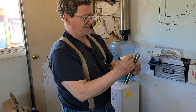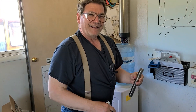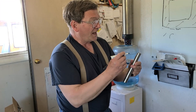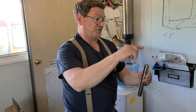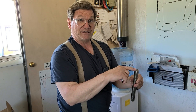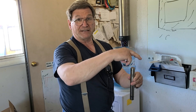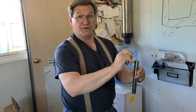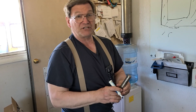That was right-handed — there, left-handed. So we have both sides threaded. You have your coupling in between — it's one set of threads in the coupling. They drill a hole usually at the side about halfway down. That's so that if there's any oil, grease, or whatever, it allows them to seat up all the way — you don't have a hydraulic lock in there.